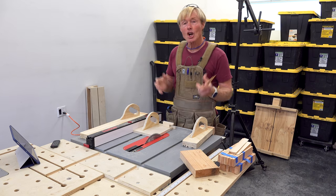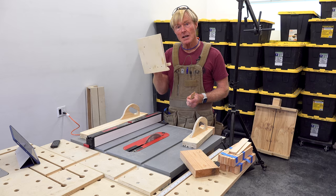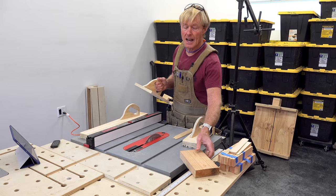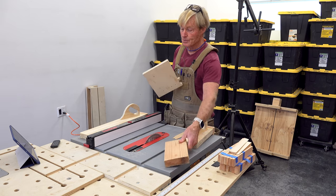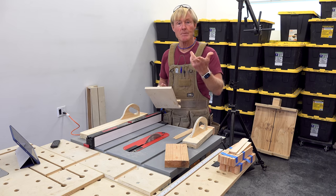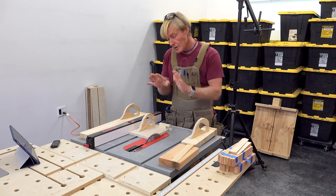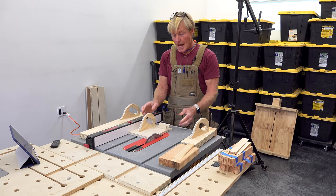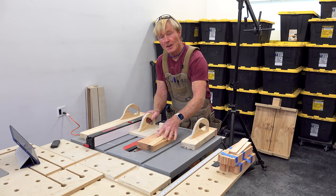In that video, Create Love Happy commented that he made his jig out of material that was as thick as the material he was cutting. So this base I make out of 18 mil ply, and it sounds like he made his out of inch and a half, or maybe even dimensional lumber. We're working with the table saw blade that is exposed and it's up pretty high — just above the thickness of the material.